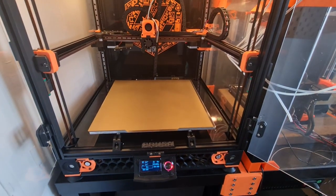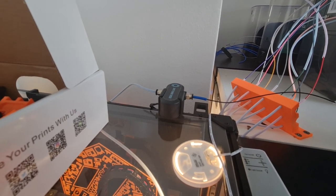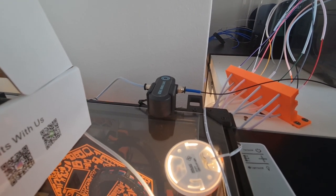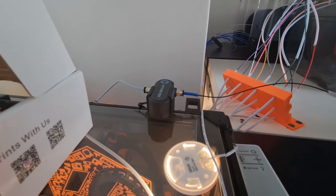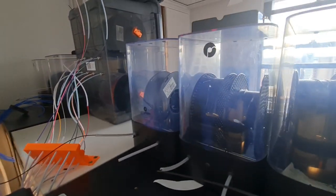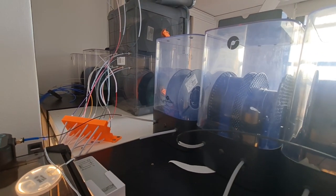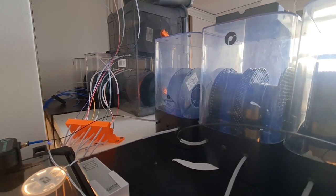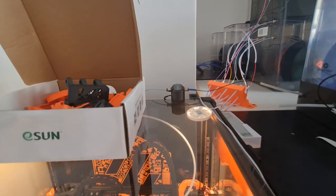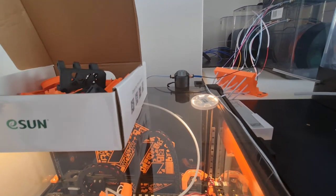It's running the Spider board with Klipper firmware. It's got the Bigtree Tech smart filament sensor, so I've got it detecting every 10mm of filament. If it gets any kind of clog and isn't extruding 10mm of filament, then it's going to pause. It's come in handy before — I had a knot on the spool so it wasn't able to extrude, and after 10mm it paused and saved the day. It's already paid for itself. I think it's only about $12, and it saved an 8-hour print.